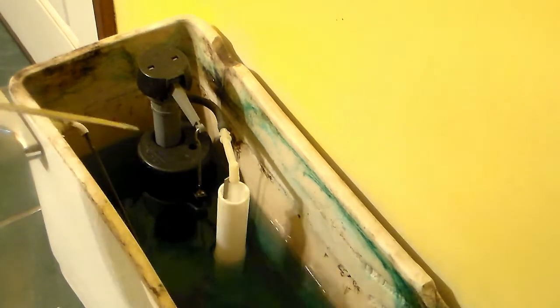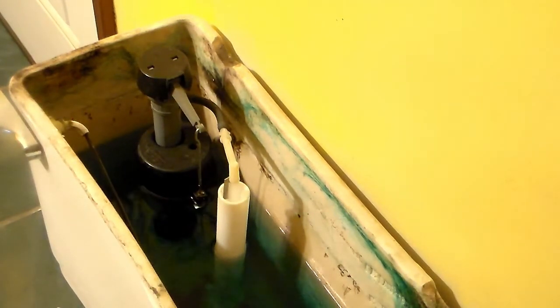I'm going to flush the toilet so we can see what's happening. When we push the handle, that chain is going to lift that flapper up and let all the water out to flush the toilet. Then you'll see that flapper go down slowly. You'll see our fill valve is filling back up, and as it fills, this float starts to rise up. When it rises up, this handle is going to lift up and click the fill valve off, stopping water from going into the tank.